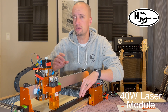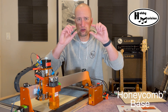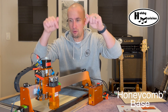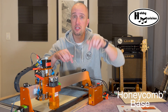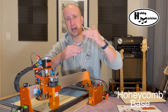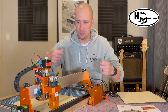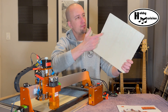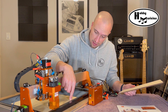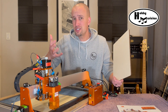The other accessory I bought specifically for laser cutting is this metal bed. It's about a half inch tall and the top is made in a honeycomb pattern, so that when the laser cuts through materials, if it gets through the material it can pass beyond the bottom — and it really does reduce scorching and singeing of whatever you're cutting. For test materials, I just went to a craft store and bought some balsa wood: one pack of about eighth-inch thin wood, and another at quarter inch.